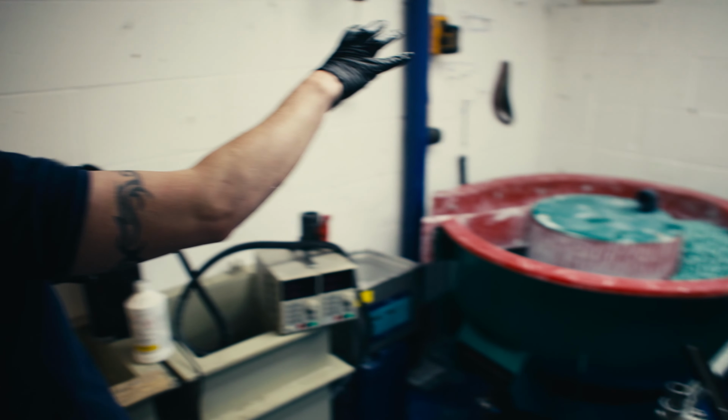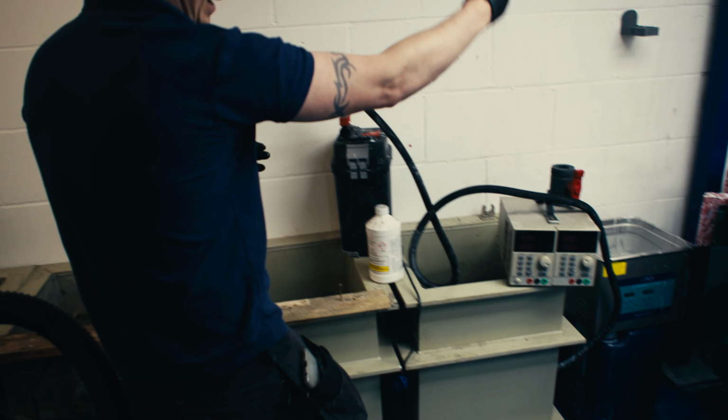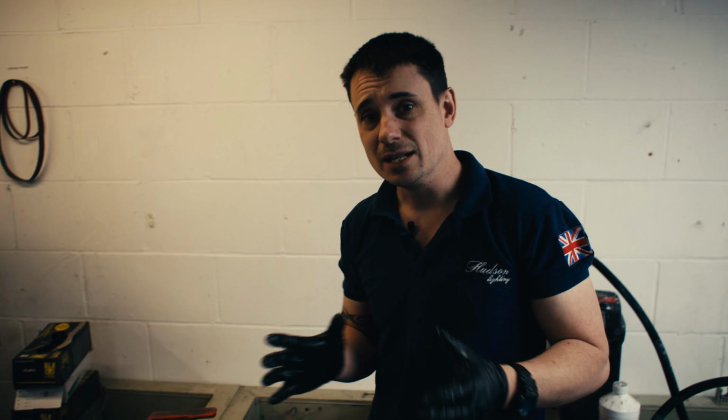And then what we're going to do is get our parts to flow through into the ultrasonic, into the clean water tank, into an etch, into an anodize, into another clean water tank and out and back upstairs. So you're going to follow me on this little journey and we'll see how this all comes together. Tomorrow I'm going to go to A1 Anodizing.